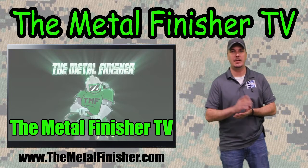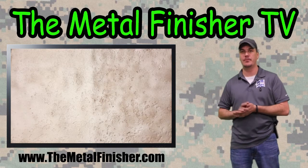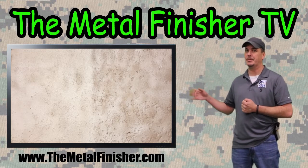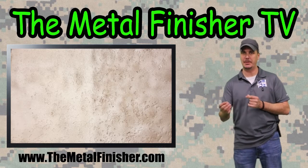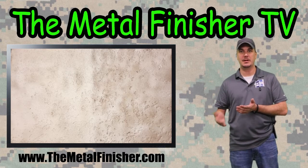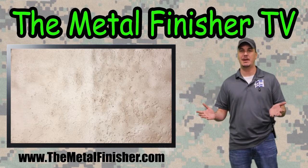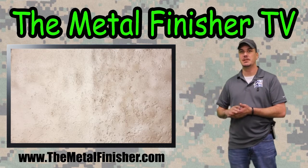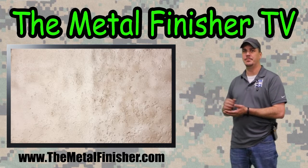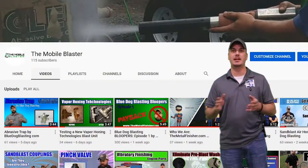All right guys, we're back from the lab and we're going to put the part up here for you to take a look at. We blasted a little more than half with the pressure system and the other half with the suction system. We used aluminum oxide on both, but the pressure system had some fresher stuff in there so it might have been a little bigger. We ran both machines at 85 PSI. From my point of view the pressure seemed a lot quicker, as expected. I also noticed the suction wasn't as pronounced as the pressure, and you can still see a little bit of residual rust or darker spots on the part.